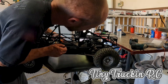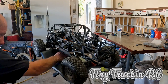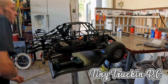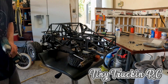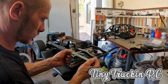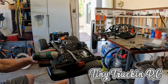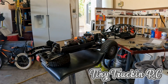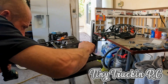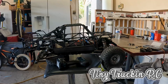We started by clamping the body to the sliders and finding that ideal centered, symmetrical position. I went to go mark the holes and the wheels were in the way, so the wheels came off. Then I used a 1/16th drill bit just to dot the hole to mark it so I can measure and double check. I dotted it, pulled the cage — there was about half a millimeter discrepancy between the two — so I just angled the first hole a little bit and it centered right up. I finished the through-hole with the 1/16th and then followed it up with the 1/8th bit.